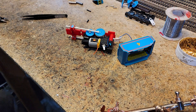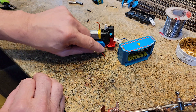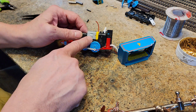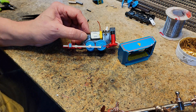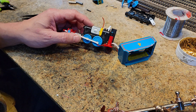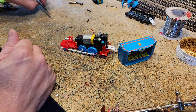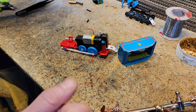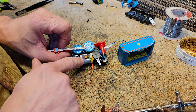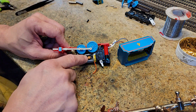Here's the fix — broken wire already trimmed back a little bit and a piece of good silicone wire added on. This is a mini 3-0 motor, like a 130 size, but not the same 130s we normally work with because it's got the newer housing. It would be considered a top mount — meant to sit flat.